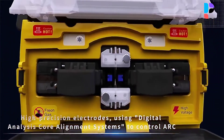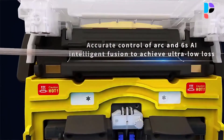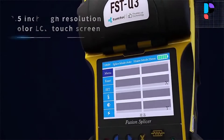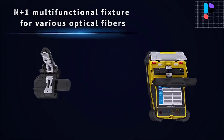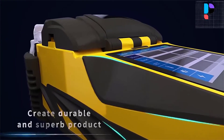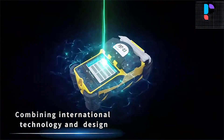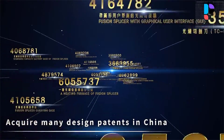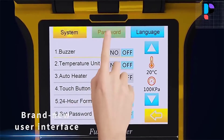The Ningjing FSTQ3 features V-groove precise alignment for high quality and low loss, with automatic arc calibration by air pressure and temperature. It adopts German numerical control technology with an integrated optical fiber adjusting frame for stable performance. Built-in Japanese components and Korean chipset enable intelligent internet connectivity. Two high power white LEDs and an illuminated keypad simplify work at night. The machine body is covered with soft rubber for shock and fall prevention, and is also dust proof, waterproof, and high temperature resistant.